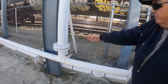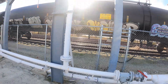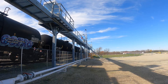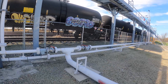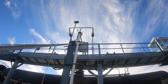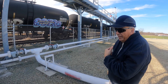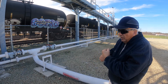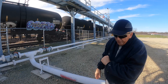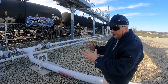My main vapor line is four inch, then reduced to three inch going up. I have a shutoff valve and then there's a red emergency shutoff valve with a nitrogen actuator — you can see it right here. That valve also has the capability of acting as an excess flow device, so if a hose were ripped off and there was a big slug of vapor, even with the actuator open the seat will drop down automatically and close off the line without requiring manual intervention.